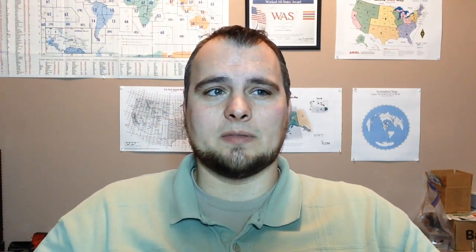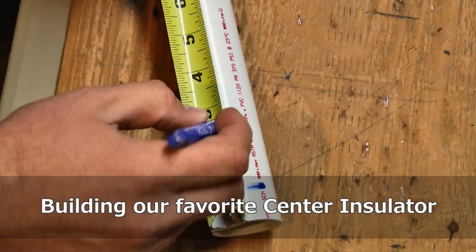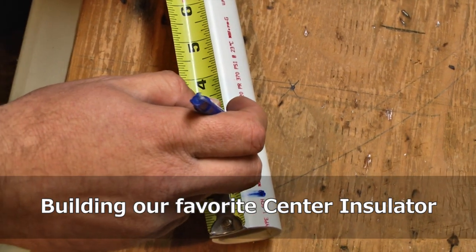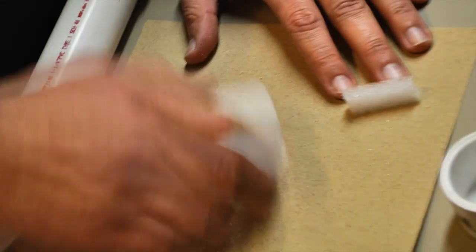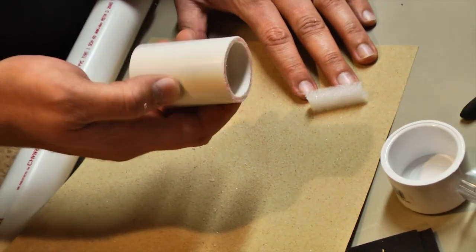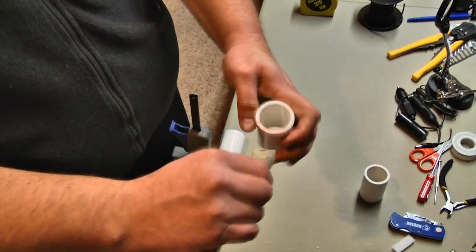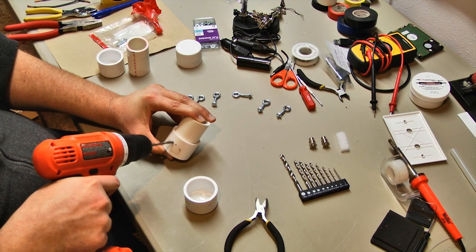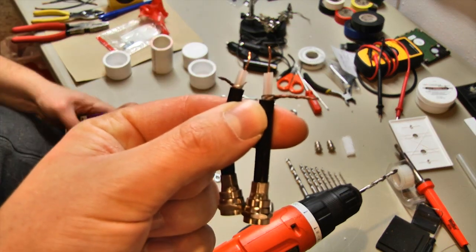For permanent center insulators we like to use eye bolts, but for portable antennas a hole in the material works just fine. The mechanical connection has to ensure that the solder never becomes the support for your antenna. As for the electrical connection, I've been working on the lineman splice that Massey uses, but until then I just use the wire nut style twist and solder method. Weatherproof with your favorite electrical sealer and secure from as much movement as possible.